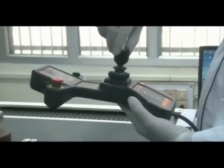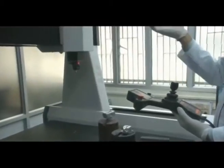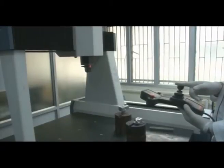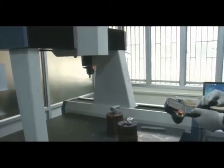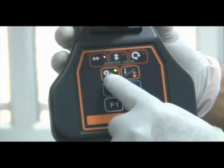The next component is the joystick. When we rotate this joystick clockwise, it moves in the Z direction downwards; anti-clockwise moves Z upwards. Moving it left gives X axis motion, right gives X axis motion in the other direction. Similarly, forward and backward give Y axis motion. The rotation of this knob — clockwise and anti-clockwise — controls the Z axis. There is also a fast-forward function.